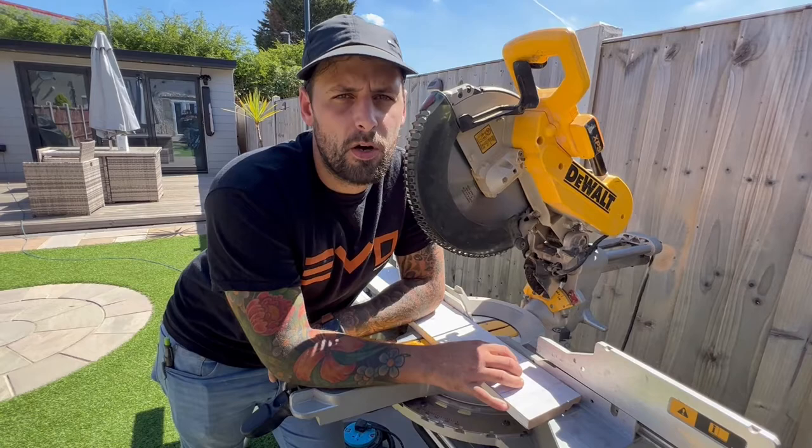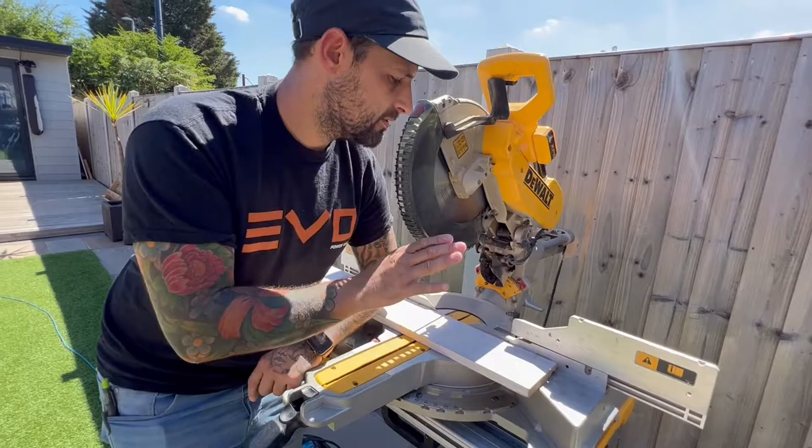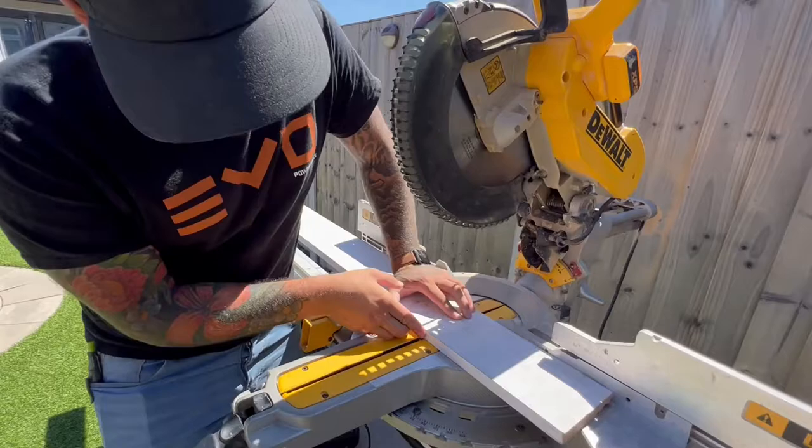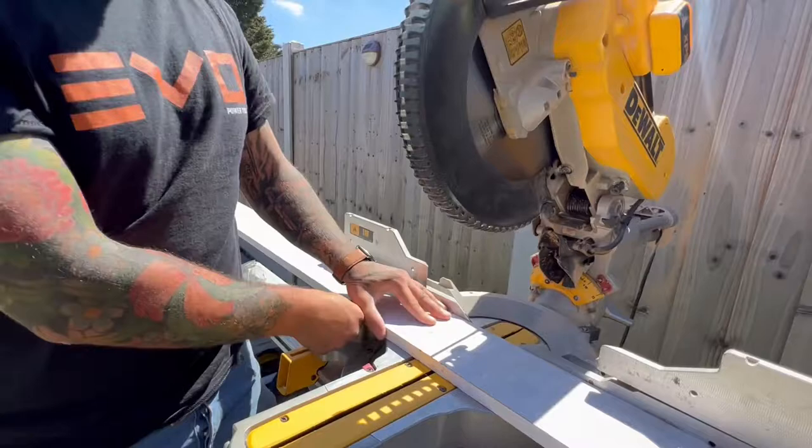There are a few ways to bend your skirting. This method requires a little bit of filling at the end and a little bit of decorating, but it can all be done in one day — you don't have to wait for steaming or bend it with weights. The first step is setting your saw to cut through your material and leave maybe a two mil face. On the face side you're going to leave maybe two mil, and you're going to make multiple cuts five mil distance between them — tighter if you need it, depending on the curve you're trying to get.